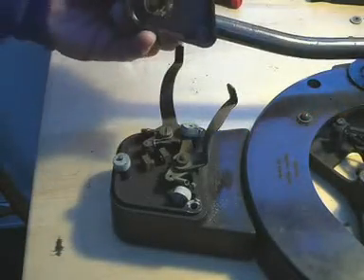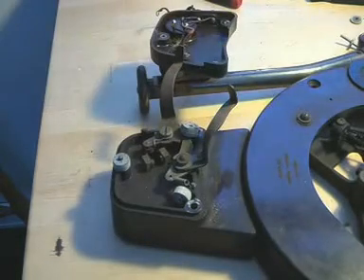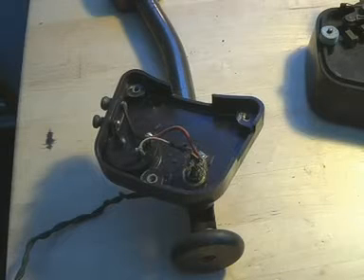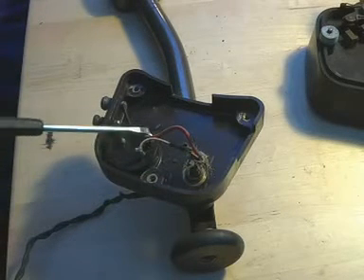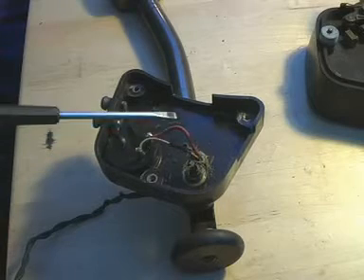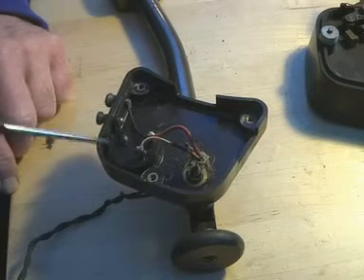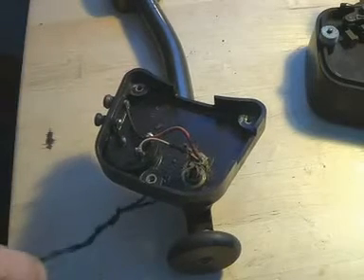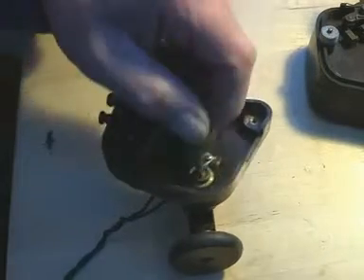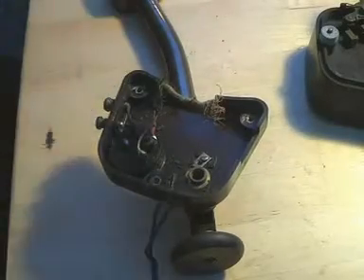Good heavens — all sorts of stuff in here. What you've got here is the original wire which came down the arm and came through here, connected to the ends of the volume control track. There's the positive red one going up to the terminal, and the wiper of the potentiometer goes out there. The only question is what's this extra wire for? Well, one wire has broken in antiquity and has been replaced — someone has threaded two more wires down the arm.